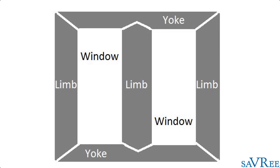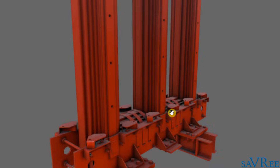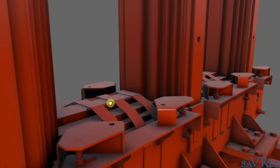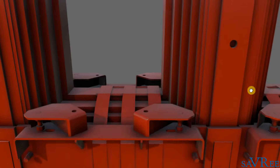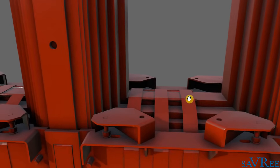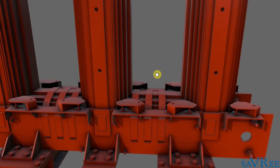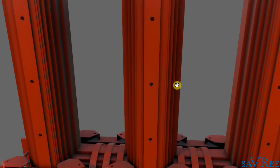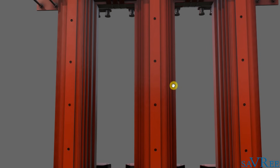The core itself is clamped together, usually using adhesive or some straps. If we look on the bottom here, we can actually see there are three straps — one, two, three — and you'll see there's also straps on the other side. The transformer core is clamped together because the core is not one solid block of metal. It's actually a series of metal sheets that have been clamped together. These are called laminate steel sheets.